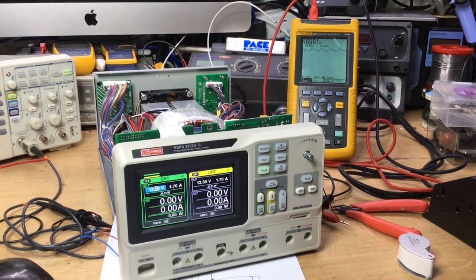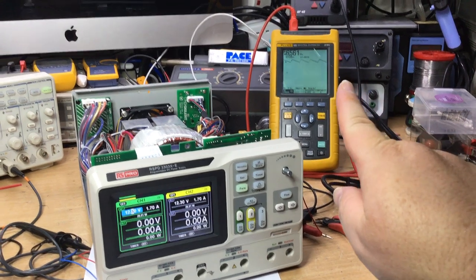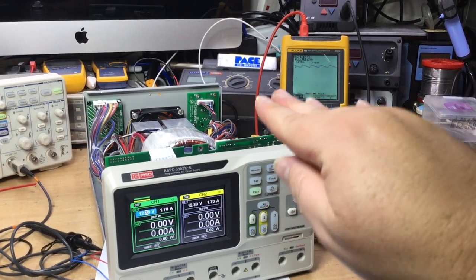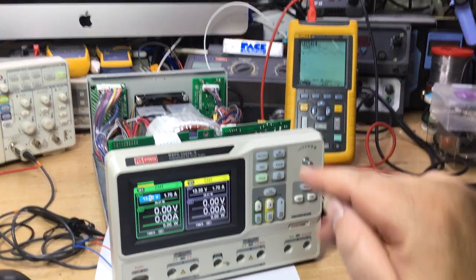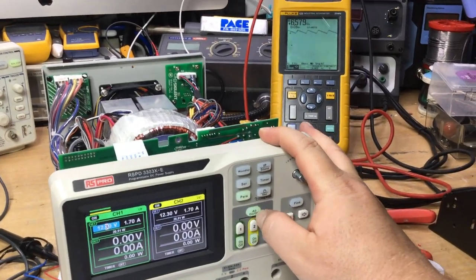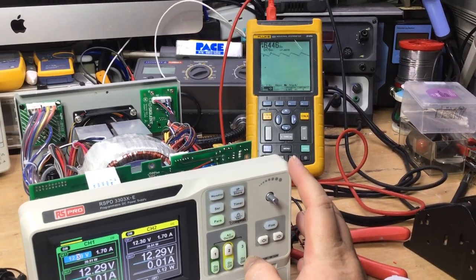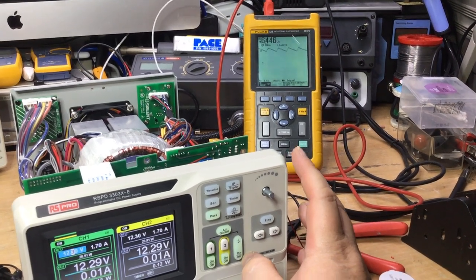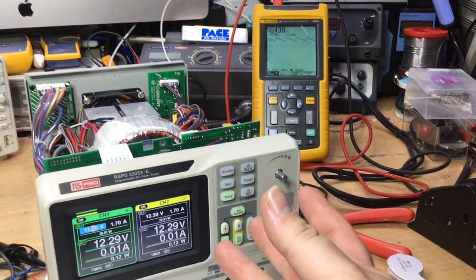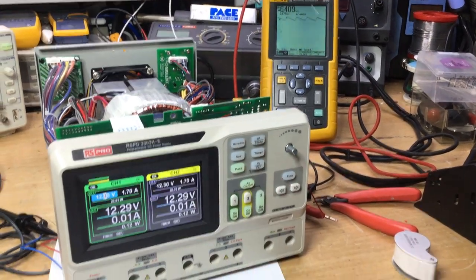So it's interesting that. But I have noticed as well the waveform on the display obviously changes slightly in amplitude, which is the unrectified, basically the reservoir caps are not keeping up with the load. That mainly happens when I introduce a more complex load on it, when all the relays are energized, then it seems to decline more quickly. But it reaches a stage where the bridge rectifier has got that hot that it just goes into a thermal shutdown and stays at roughly 2.9 volts DC.